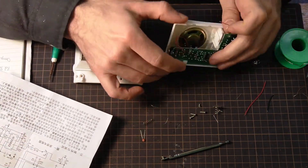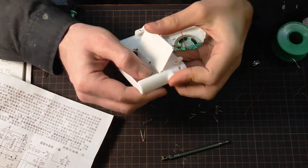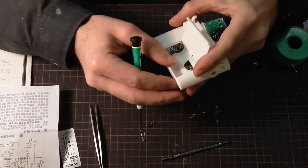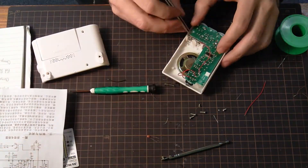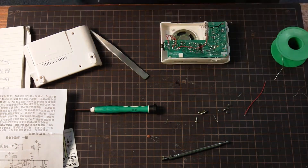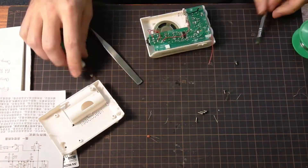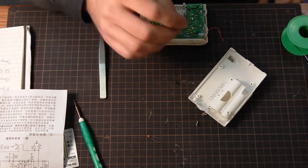Here I am now looking for where I'm going to connect the batteries. This spot I believe was the place labeled positive after just kind of logicking things out — the process of deduction. I figured out that that plus was probably not for the speaker positive, it was probably for the battery positive terminal. Initially I thought it was for the speaker, but based on the schematic I just needed to connect to a ground for the negative terminal. I used the black wire because black is negative, and I stuck it to the closest terminal I could find, which turned out to be the wrong one. But it turned out to be also extremely close, so we'll see very soon what happened.